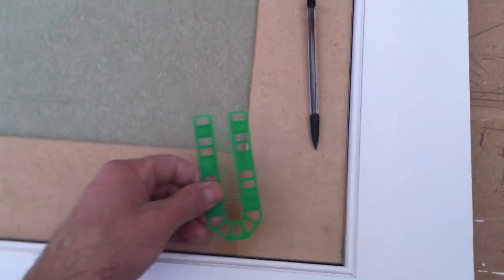To trim them, I've put the two doors together with my gap the way I want it where they meet and overlap — that's about 2mm. I've then dropped the frame over them. I made these so that together they're about a millimetre undersized to the frame. They want to end up with 2mm gaps all round, so the millimetre undersized meant they were just small enough for the frame to fit over them. It also gave me a bit of adjustment for any out-of-squareness, which I'm correcting using a 2mm packer.